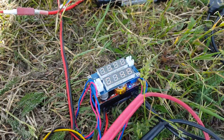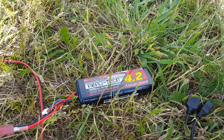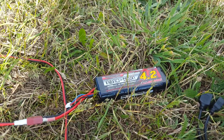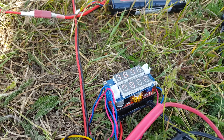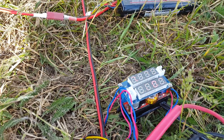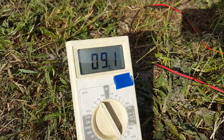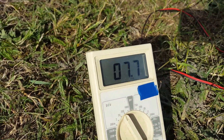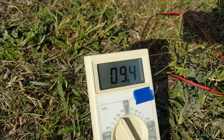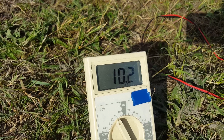Because I use a DC buck converter, I'm actually decoupling the power from this 2S LiPo. So the input voltage and the output voltage are then regulated. This DC-DC converter actually has a constant current mode as well, which I haven't triggered yet — I don't have the screwdriver with me to adjust it. But it doesn't matter since the current isn't high enough. It's nice to see that the input and output voltage are not directly coupled. The input voltage won't go up as high because it's coupled to the battery. If I decouple the battery you'd actually see it go up towards something like 30-plus volts.